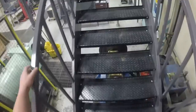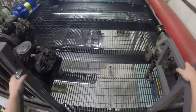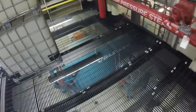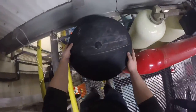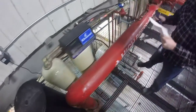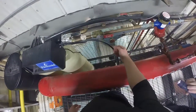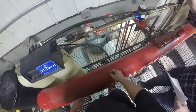Proceed upstairs to the mezzanine using the handrails for safety. Check the level in the brine tank — the level should be about two to two and a half inches. Check valves 40, 42, and 43 are all open and valve 41 is closed.